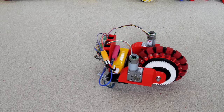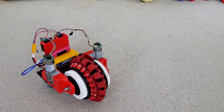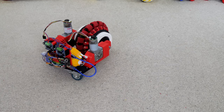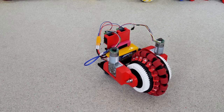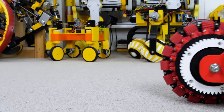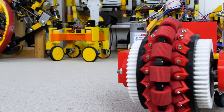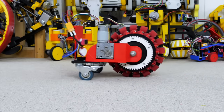The motors are pretty slow — if we were going to make a balancing robot we'd need something with much more velocity and also power at that high velocity, so typically I'd use a brushless motor for that. But I really wanted to see whether this was going to work, and going much slower with really a lot of power from those geared motors with worm gears we can see how much friction there is as well. So far I'm pretty happy — we can see all the functions are mixing together. If I drive forward and backwards that's good because both motors are working at once, and if I try and drive forward or backwards and sideways then you can see that one side of the hub stops and we've only got one driving it, which causes that hybrid motion. It's very interesting that we could have a vehicle with just one active wheel driven with both axes and casters — it looks a bit like R2D2 so I guess we could have a droid with just one of these in its front foot and casters in the back feet.